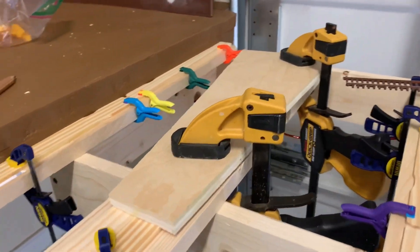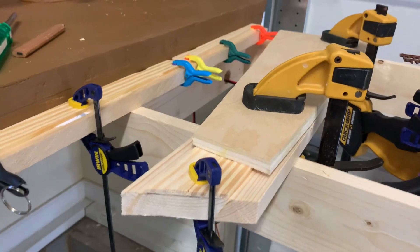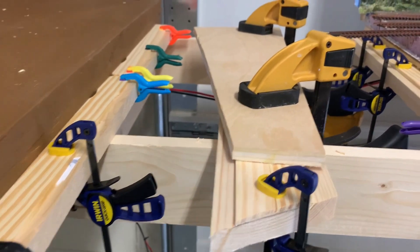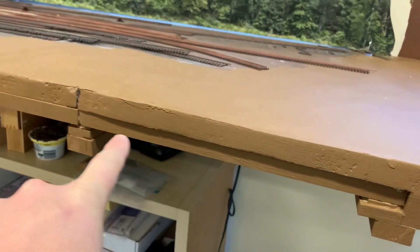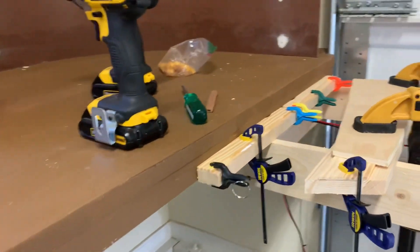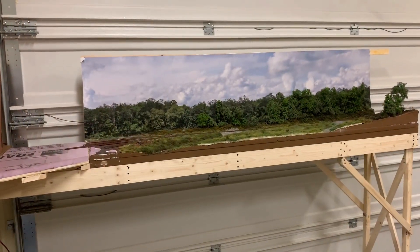Here's what the structure is going to look like underneath - a little bit of plywood sitting in this area. Matching the door thickness is just awkward, but I found that paint stirrers work as nice little spacers. I actually did the same thing in the section over here - you can see one there and one there. Problem solved. I used wood glue to attach those and today I'm going to work on getting this plywood cut and mounted and the backdrop extended between the two sections.